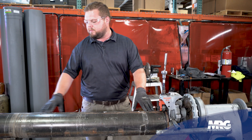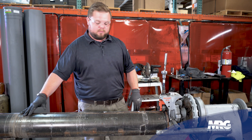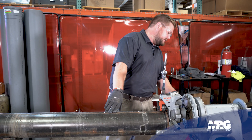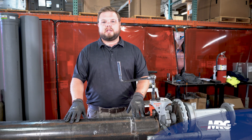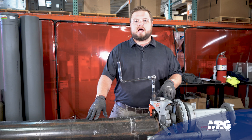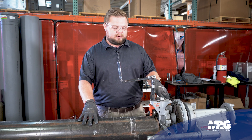I've made sure that we are setting level and square with our pipe into our machine here. We're setting in our V-groove stand here and I'm also going to make sure on the other side of this machine that we're set to reverse. Today we're going to be grooving six-inch schedule 40 carbon steel pipe, which for the Ridgid 975 Combo Groover is the largest material that we can actually groove.